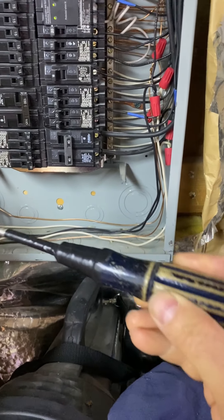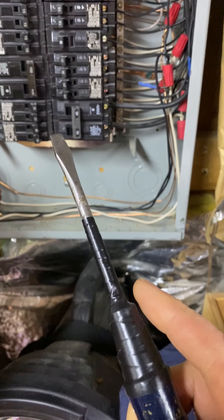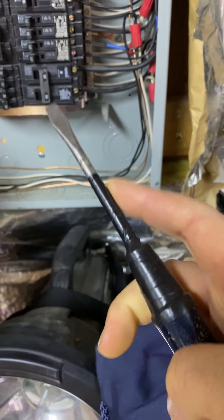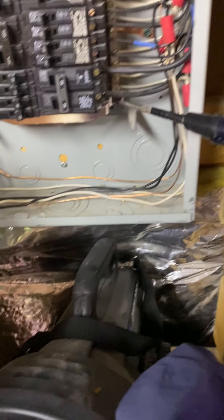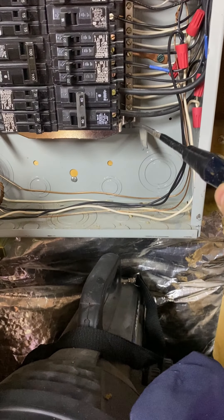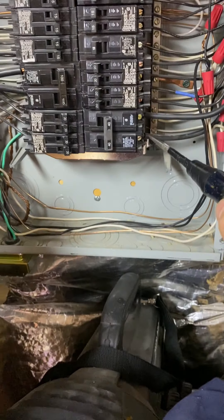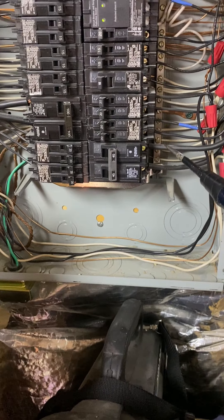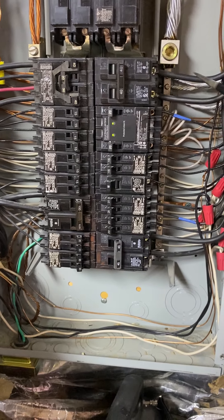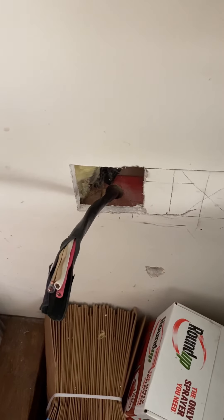This is my father's screwdriver for doing electrical work — he used to wrap electrical tape around it, it was getting pretty ratty, so I just put new electrical tape on it. It protects you from shorting out, just in case. Even though this is off and not hot, working in an electrical panel you have to be very careful. I'm going to remove these two wires, pull these two breakers out, put the new double up here, and run the wires back in.